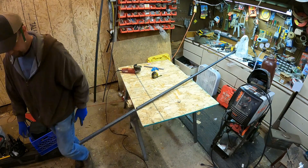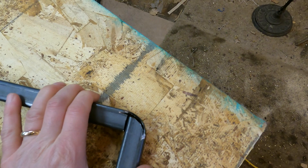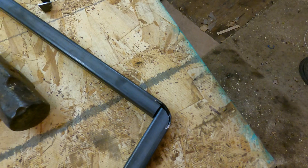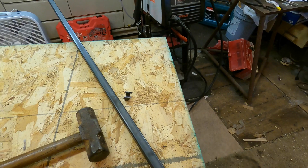Here you're able to get the idea of what I'm going for. I think this will be totally weldable once I — there's no reason you need a four-pound maul to bend this around, it's just the closest hammer I had. So a little bit of grinding, a little bit of tweaking, I think that's going to be quite nice. I want it 37 inches wide or thereabouts, maybe a little longer. So I'll figure out how to get the contour on the other side, make another corner, and keep on plugging away.